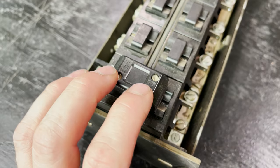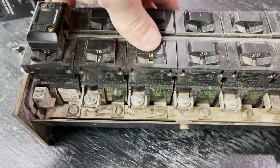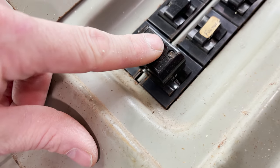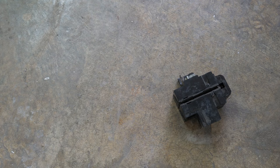These breakers are grease-fed, which means for them to work properly you have to push and cycle or exercise the breakers often to keep that grease worked in — that's how they maintain longevity. Nobody's doing that. You install a panel and you're not out there cycling the breakers to keep them greased. So as these things age over 30 years, they really stiffen up on the inside from the lack of grease. Being able to push them in to reset or test them becomes really difficult.